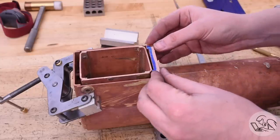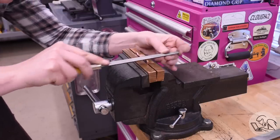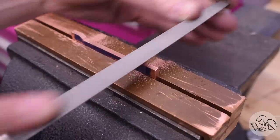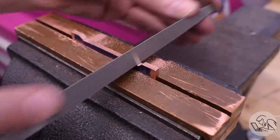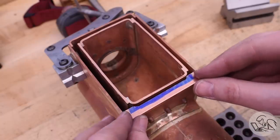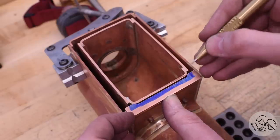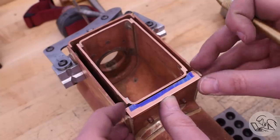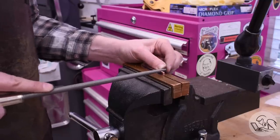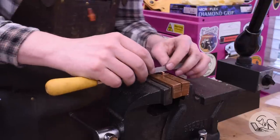You can start to see how my sneaking up plan is going to work now — I've got a square U-shape there. Then I move on to the triangular file and knock the corners off of my square U-shape. Those corners are going to land on the tangents of the curves at some point, and that will give me a position to start filing the curvature into place. When doing this, it's really important to have a consistent reference each time you test fit, because otherwise you can wander off course and not realize it. I switch to the round file and start to form the curvature on each end, and I'm also draw filing to blend the curves into the base as needed.